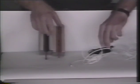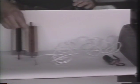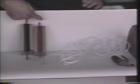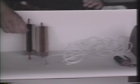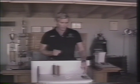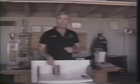Both of these charges are fired by means of our little Instadet firing system. It consists of a blasting cap, a 20-foot length of flash tube, and a fused firing mechanism. In use, the blasting cap is taped to one of the cords, the ends of which are sticking out of the cutting charges. You peel the covers off the sticky tape off the charges, walk up, stick them over the lock, pull the pin in the firing mechanism, toss it gently to the ground. 1 second later, a micro-detonator will fire and send a flash of fire down the inside of that hollow plastic tube at 6,000 feet a second. What this means is you have essentially instantaneous, remote, non-electric detonation of the cutting charge.